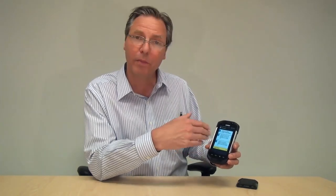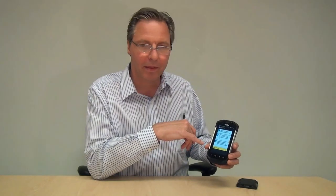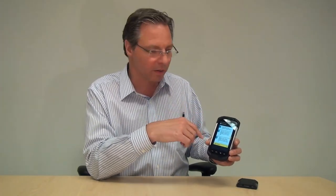Two minutes is important. We have a supercap in the device. That supercap has enough power to keep the device in battery swap mode with no battery installed for up to two minutes. If you leave the battery in, even if you're down around the point of critical suspend — which is around 4% on this battery — you'll still be able to remain with the battery in for about 24 hours. But if you pull that battery out, you have two minutes to put a new battery in.